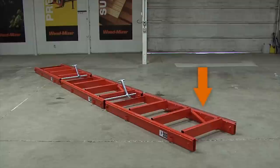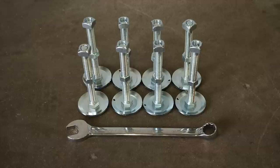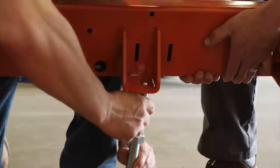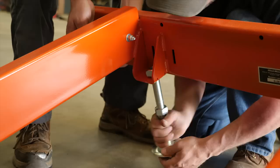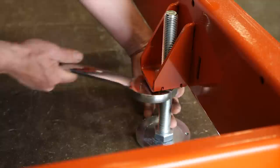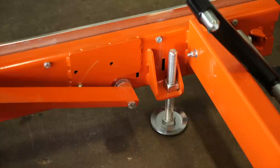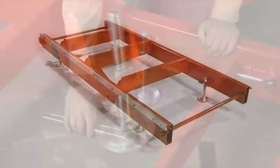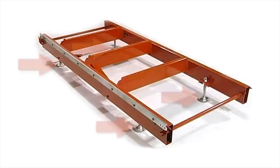Before attaching the beds together, install the leveling legs. Notice the hex head goes on first and is positioned about midway down the threaded part of the leg. Once this is on, insert the leg into the bracket that is welded to the bed frame, then install the square nut to the top part of the leg. To tighten or readjust the leg, use a 1-5/16 inch wrench. Once you have the first one completed, continue and install the rest. The beds should be approximately level for ease of operation and each leveling leg should be supporting bed weight.